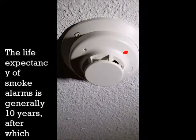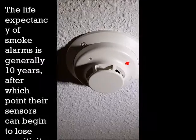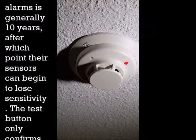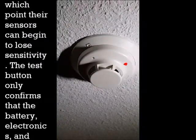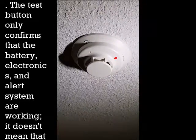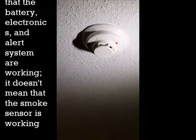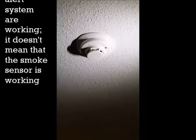The reason we replace the smoke detector is because of sensitivity. Inside the smoke detector we have a radioactive element, and after 10 or 20 years this radioactive material gets weak, so the detector becomes either too sensitive or less sensitive. We would have to do a sensitivity test with special tools to check it, but after 10 years it's hard to get the sensitivity right. The other option is to replace the smoke detector, which is cheaper and better.